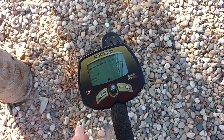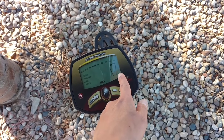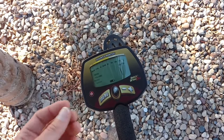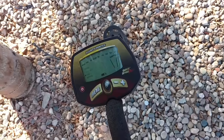From my experience, three arrows means more than six inches down. This metal detector detects up to about nine inches for a coin-shaped object. The pinpointer button and depth indicator are calibrated to a coin-sized object. If you have a smaller or larger object, you'll have to figure out the depth accordingly.